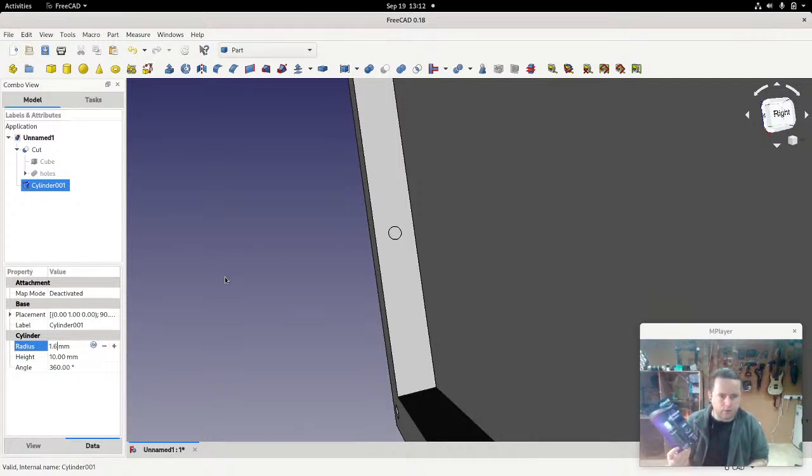So this, for example, is like a gel glue. You can put it in and it will set after a while, but it's not a super glue. It's not going to go ultra hard, and even after it's set, it's still kind of rubbery. Like the electronics I have at the back here, I stuck in place using that gel, and it feels rubbery. If I want, I can rip it off, and it won't do any damage to the plastic, so I can put it on again. So it's a choice between glues. But a useful thing about it is that it is transparent, so you can put an LED in it, and even if you get a little bit on the LED, it should be fine.